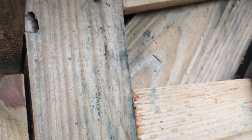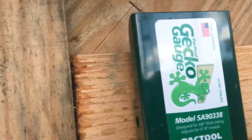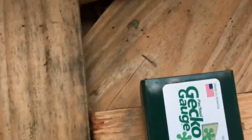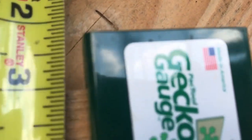I come over here on my other end. Forgive me, I'll have to move this, but we'll just make it all in one video. Got to move my little step ladder here. And I highly doubt this structure is square. I can tell by looking at it that it's not. So scoot that over. Open my tape measure with my teeth. Do the same thing. So we're going to butt up against the lowest point. We're going to see where it sits on our notch. What is that, 4.25?